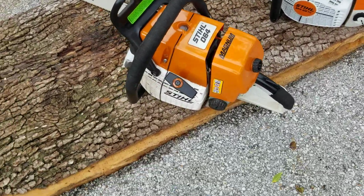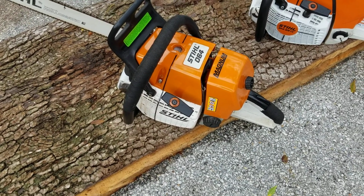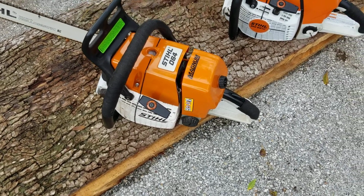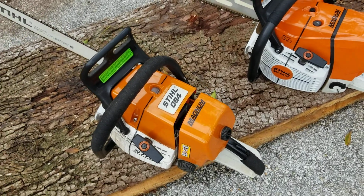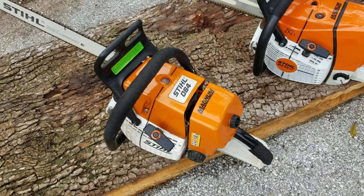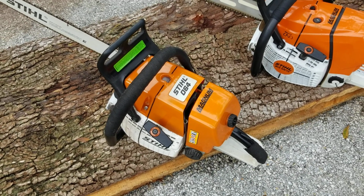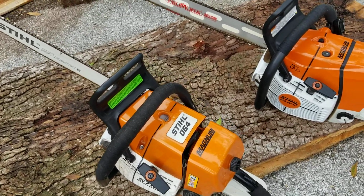660 Farmer Tech kit with the OEM 660 crank seals and bearings, side cover, intake boot, WJ64 carburetor, pristine 064 cylinder that I modified to fit on this saw. It's 85 cc's now, runs excellent. Unported, unmilled, just a stock cylinder, dual port muffler with no baffle.